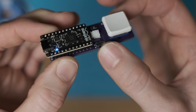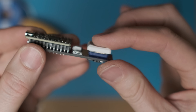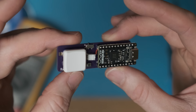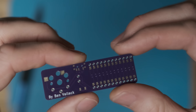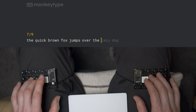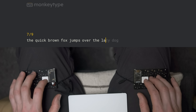This keyboard uses the format I've been using for my current custom keyboards: they've got the reset switch, the power slider, the JST battery connector, and they use batteries with the Nice Nano for a fully wireless build. We're also using hot swappable Choc key switches. This one key keyboard idea is a sort of joke that's gone a little bit too far, but it's actually quite a good way of showing the build process for these custom keyboards, because you can add more keys and create a useful keyboard in whatever layout suits you using the same format.